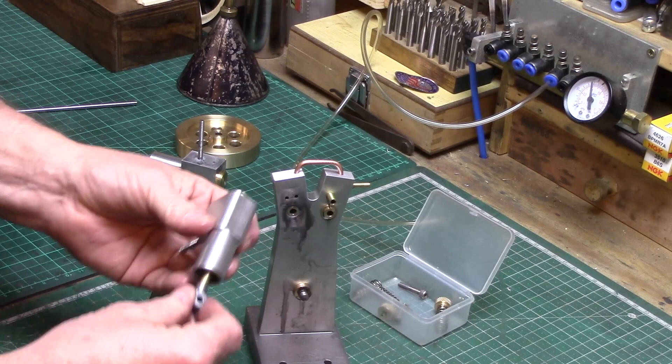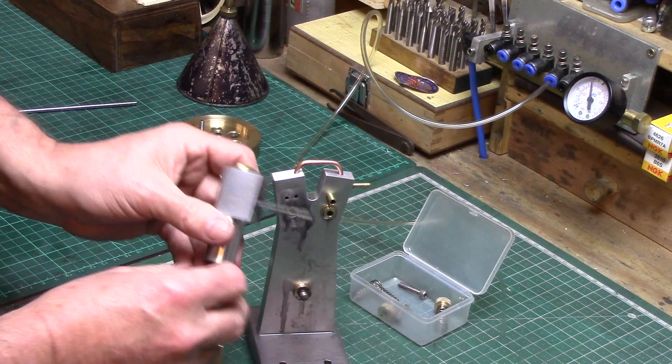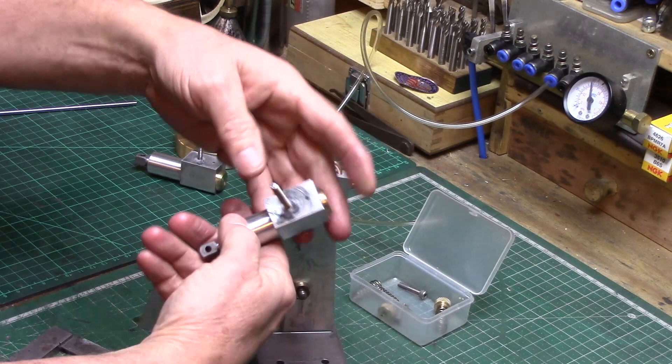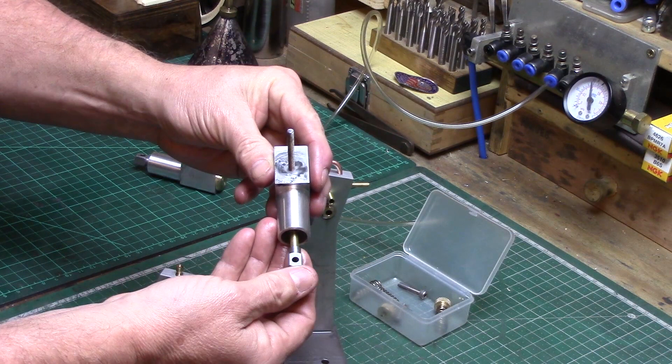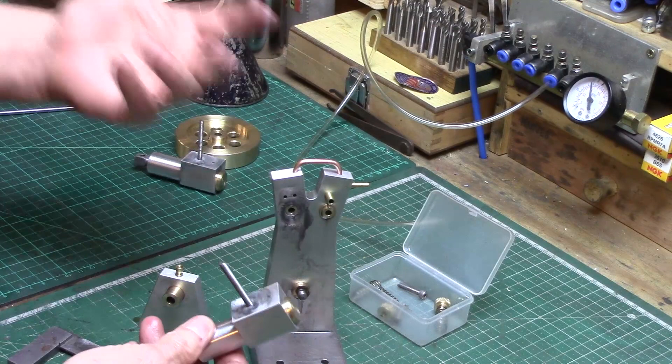All the pistons were smooth and I just couldn't figure it. Eventually I narrowed it down - what was happening was when the piston was rising up to the top, it was getting locked, basically air locked. The piston was obviously coming past the porthole and it still had a little bit of travel, and obviously it was compressing against, well, compressed air with nowhere to go. Although it would run with really high pressure, it just wouldn't run slow and it was very lumpy.